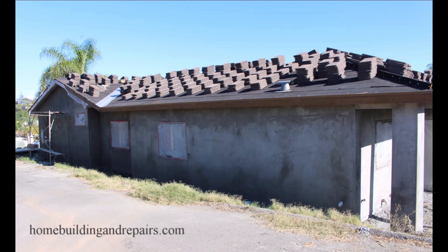Here is a quick tip for new home builders: make sure that the roofs are loaded. All of the shingles should be on top of the roof to allow for the weight to be distributed evenly down through the wall framing. Otherwise you could end up with some structural cracks if you install the stucco before installing or loading the roof.